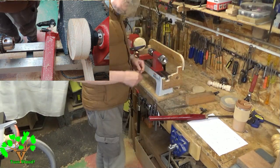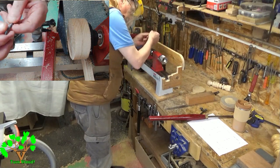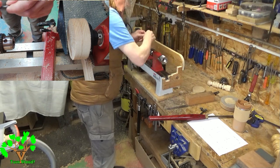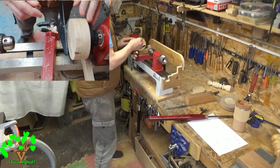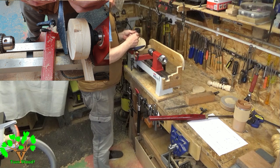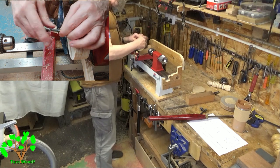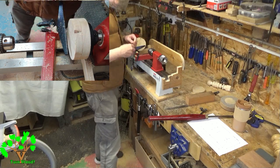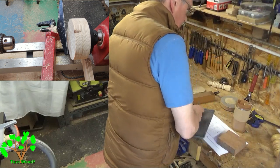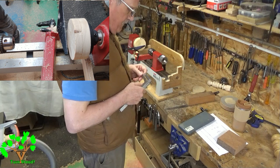Now we want to drill a hole the root diameter of the screw, not the overall diameter, for obvious reasons, and the thread wants to be exposed. So even though we'll be screwing into the wood, it will give us a firmer base when we put araldite or a glue on it to glue it in position. So I'll just test for the root diameter of the screw.